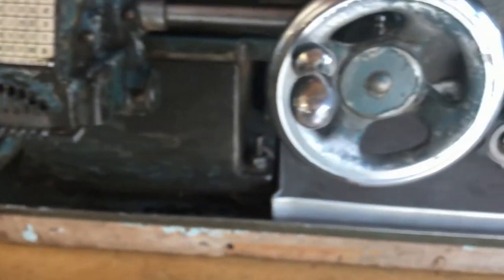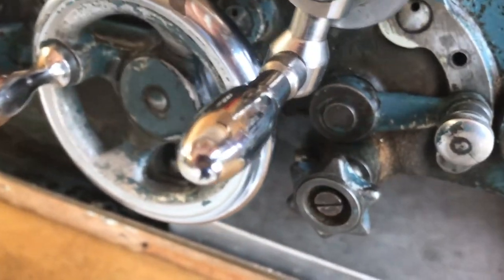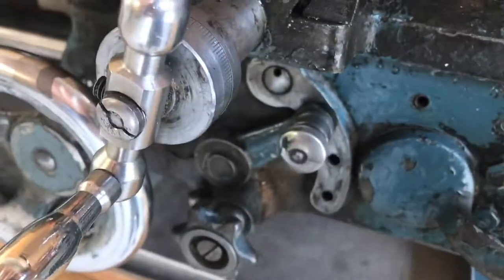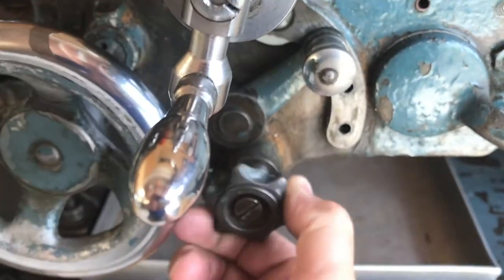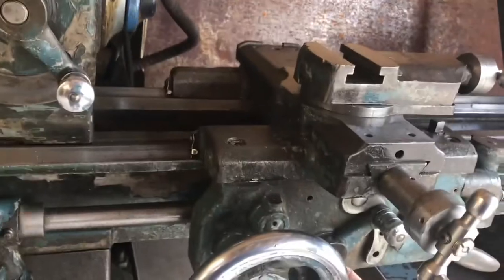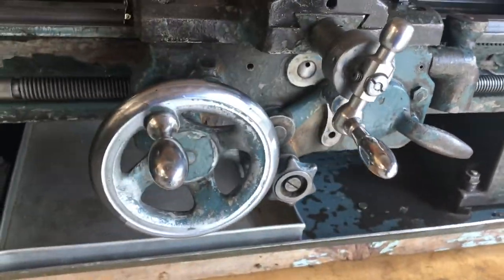Checking if we missed any major controls — this section on the apron: in the neutral position it's used with the half nut connecting directly to the lead screw for thread cutting. However, there's an alternative: in the upwards position that gives automated power feed movement of the apron along the bed. The lead screw is set up fast here to exaggerate the demonstration. There's also a clutch knob — you can turn it on or off. You can see the apron or saddle moving along quite fast with the power feed engaged, and releasing the clutch by turning left stops the movement.